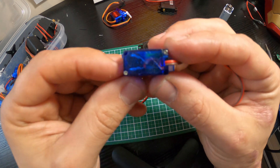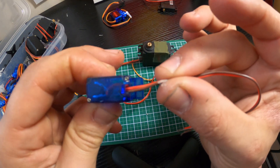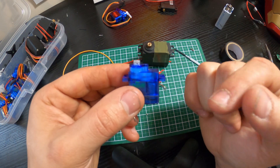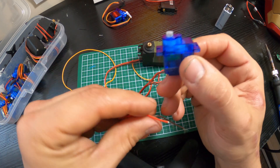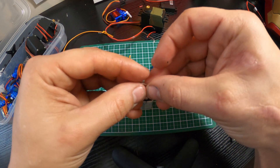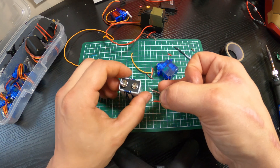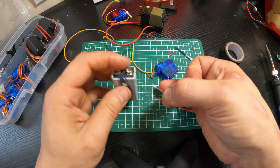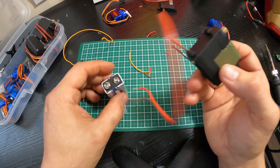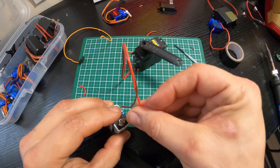With these little plastic ones, there's a lot less room inside as you can see, but I did the knot trick so no matter what I pull on they're not going to come loose. If you're using a 9-volt on a tiny plastic-geared servo, that's going to strip them out very quickly — I wouldn't even use a 9-volt to test these. If you listen you can actually hear the gears click and slam at the end stops, and after doing that over and over you'll start to strip the plastic gears out and the servo will die. Stick with 5 volts or 3 volts, or get the metal gear servos.